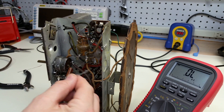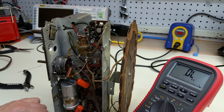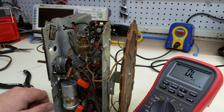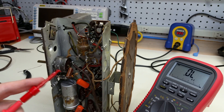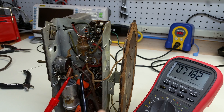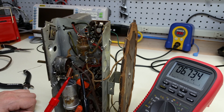I've cut off this resistor because I'm highly skeptical that it hasn't drifted. I just cut it instead of desoldering it. The color code — orange, black, green — means this resistor should be in the neighborhood of 3 megaohms. Let's see what it measures. Wow — it's off by a factor of over 2. This one weighs in at nearly 6.8 megaohms. I think we're going to see that all the way through with all of these resistors. So all the resistors are going to have to go.